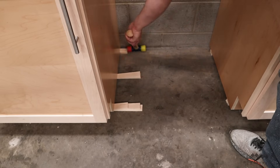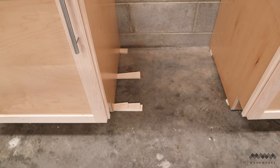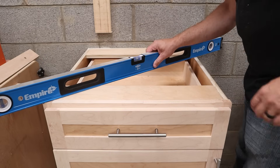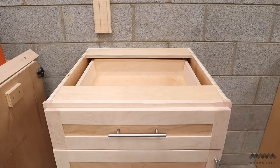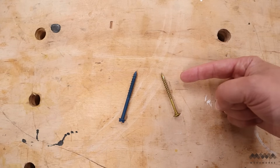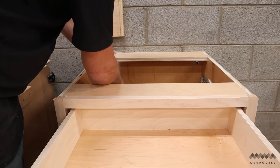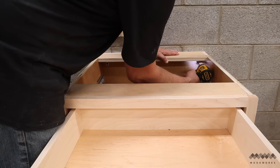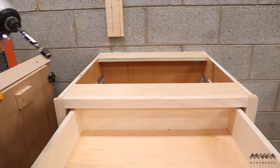Besides that, I want to add base trim to the bottom of these cabinets when I'm done, so leveling feet would be inaccessible anyways. I tap the shims in, continuously checking for level, and once that's done I can screw it to the wall. Now since this wall is cinder block, I'm using Tapcon masonry screws instead of traditional cabinet screws. I have a short video on how to attach cabinetry to this kind of wall, so if that's your situation you can check out that video next — I'll leave a link in the description.